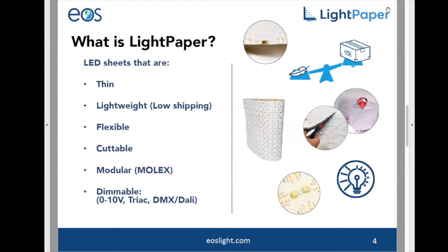So what's light paper? Well, light paper is thin, lightweight, flexible, cuttable, and modular. They're also dimmable with the respective dimmable drivers: 0 to 10 volt, Triac, DMX, Dali, same as I previously mentioned. You can go ahead and cut that. If you have a sprinkler head that you need to make that cut for, we can go ahead and be cut on site. With dim to warm, they're cuttable squares of an inch by an inch.